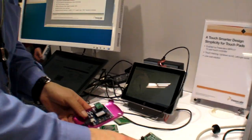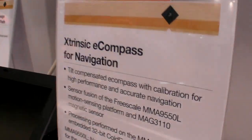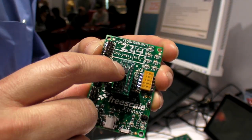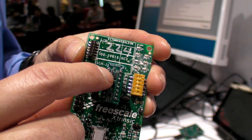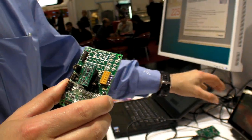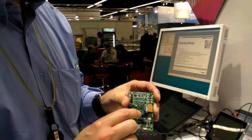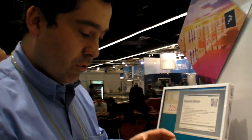In addition, what has been nominated for the Embedded Award is the MMA 9550. This is an accelerometer with a 32-bit microcontroller inside. We are doing exactly the same tilt compensation for the magnetometers, but what is new is that we have the software for the tilt compensation embedded inside the accelerometer.